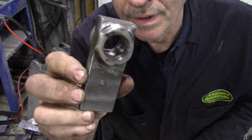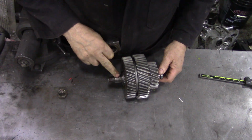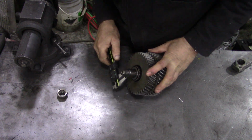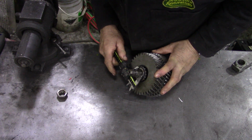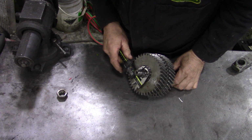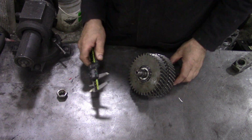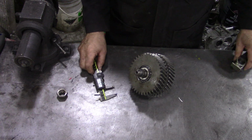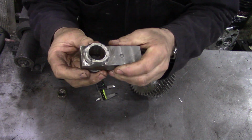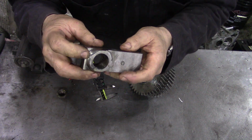And it's really simple. Now, JP bored a hole in that which was the same diameter as the shaft, which is approximately 25mm. Or is it 24.86? Wait a minute, let's get a better place. I have to keep resetting this thing, I don't know why. 25mm, exactly. So that's easy enough, isn't it? He just got a bit of square bar and bored it out, but what we found was a problem, and you can see this rough welding I did on the outside here.